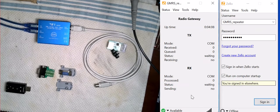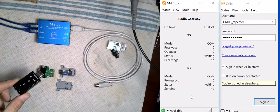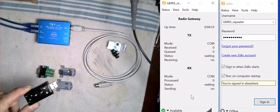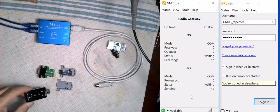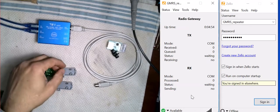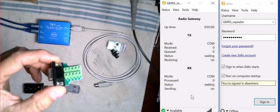The other plus is it's cheaper for parts. You can use a USB sound card dongle or your built-in sound card if your computer has headphone jacks, but sometimes it's best to just buy the USB dongle because it's about three dollars and it's going to work well. If you like to solder, you can buy a DB9 female connector with a hood to put it together, or if you can't solder, they sell a terminal block version where you just use screws.